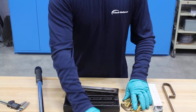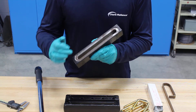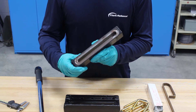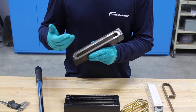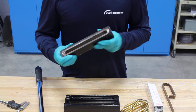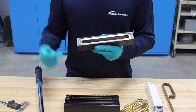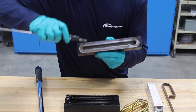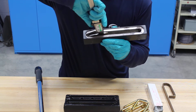Since this is a new gauge I'm not going to replace the bolts. Next thing you want to do is inspect the chamber. The recessed surface there — you want to make sure there's no pitting or gouging; it needs to be even and flat. If you do notice there are gouges on it, you can take one or two skim cuts on a milling machine, but a minimum material thickness of 0.100 inches between the through-bore and the recessed surface has to be maintained. You want to make sure you measure that dimension of the through-bore to confirm there's enough material there.